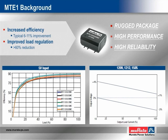Efficiency of the MTE-1 models is improved over that of competitive offerings by 3 to 18 percentage points, with most models offering an advantage of 6 to 11 percentage points over the best competitive models. The increase in efficiency not only makes the MTE-1 attractive from the application perspective of less power consumption and simpler thermal management, but the reduction in heat dissipation also reduces internal hotspots, which consequently increases reliability. Remember the rule of thumb that states that for every 10 degree decrease in temperature, the reliability doubles.